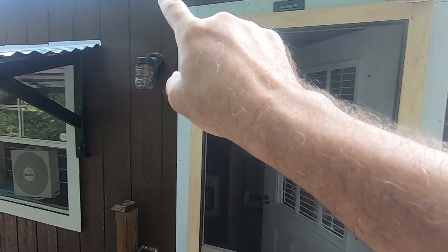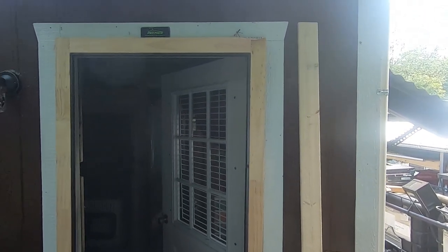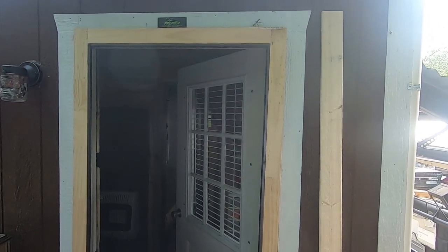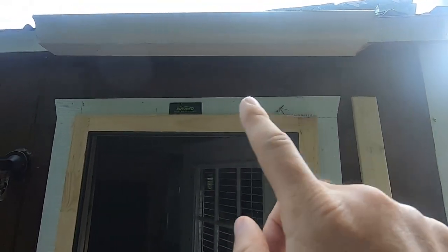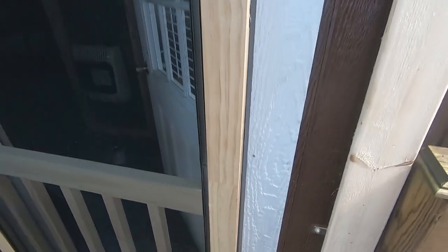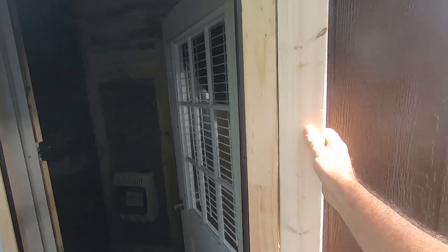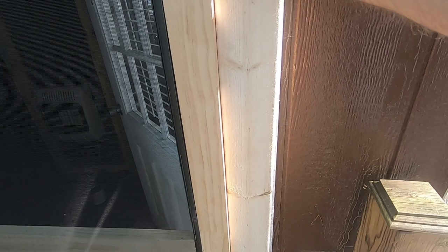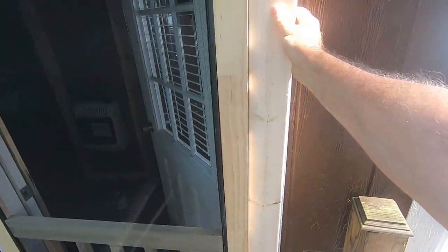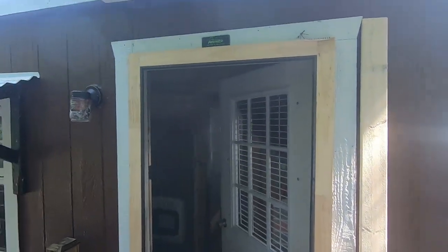Here's the door frame. A really bad assumption is to assume that these things are square — they're not. Off camera I picked that up and it is not level, but this door is sitting level. You see that gap? If you try to match everything up perfectly you'd have a drinking problem. So this will take care of your drinking problem — bring that board over and it fills that gap in. Nice little trick so you don't wind up killing yourself over it.